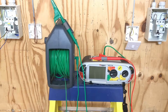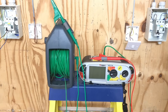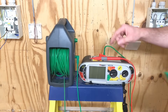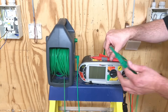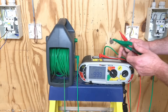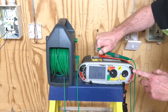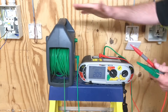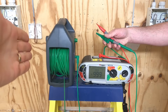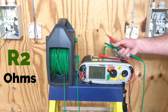We've got our long wandering lead and our multifunction tester here. Before we start doing the test we set our probes up — I've disconnected the probe from the Megger MFT and inserted it into the side of the long wandering lead, and I've unravelled my lead. I'm going to need to remove the resistance of this 50-metre long wandering lead and the leads that come with the Megger MFT. We set it to ohms, link the two together, press nice and firm into place, press it once, press it twice, and we've got zero. So we've removed the resistance of the long wandering lead and test leads and we're now ready to carry out the test. Any test we do now won't take into account that lead resistance — it'll just be the true measurement of the resistance of the CPC, which we can record as R2 in our test paperwork, measured in ohms.